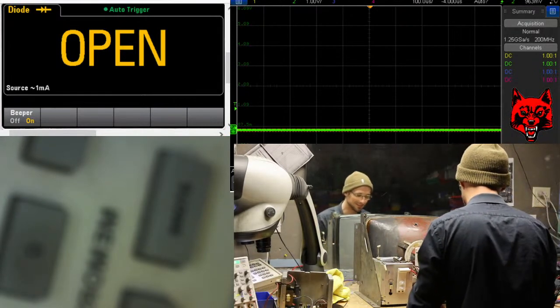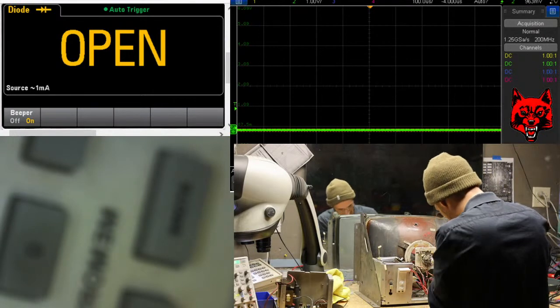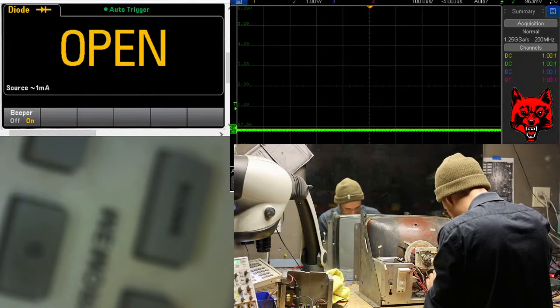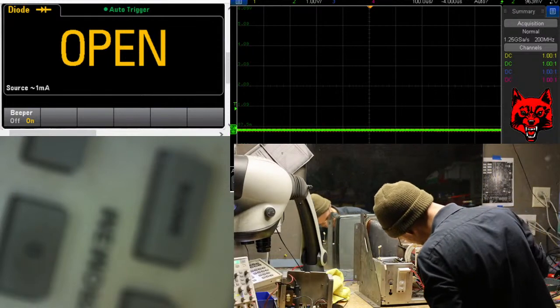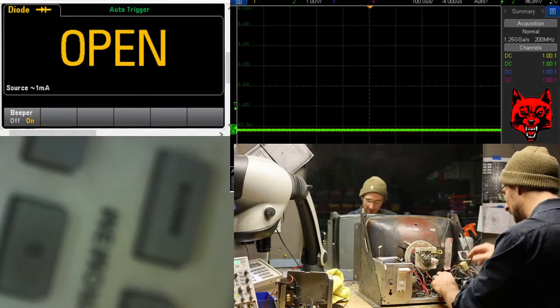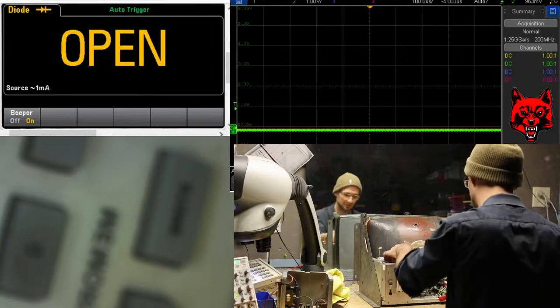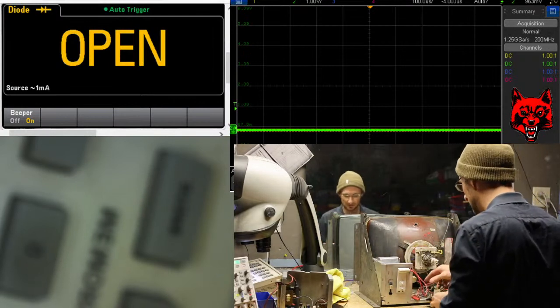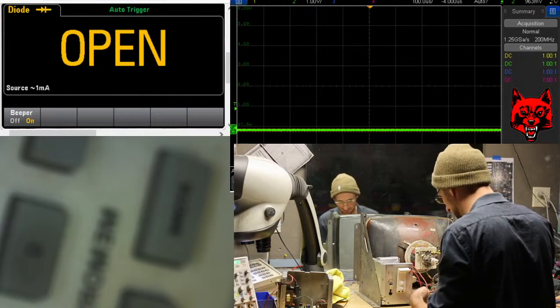Place it in here. I'm going to plug the yoke in, and one set of the power transistors. I'm going to keep the two deflection ones off. I'm going to plug in this ground. I'm going to unplug the HVA. We're going to see what it's doing raw, alone. I shouldn't say raw, rebuilt.